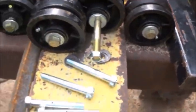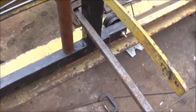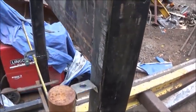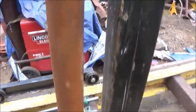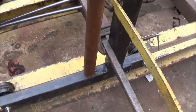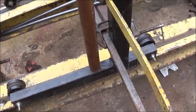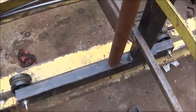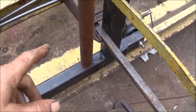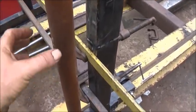Got the carriage pretty much welded together — just tacked for now because I don't like to make anything permanent the way I engineer and design. I've got two solid rods and I don't mind the weight here because this thing is going to be power feed and I've got plenty of power. The heavier it is, I personally think the better it'll do. The plan is to go find a couple of old hydraulic cylinders with a two-inch bore inside that will slide up and down these two-inch solid bars.